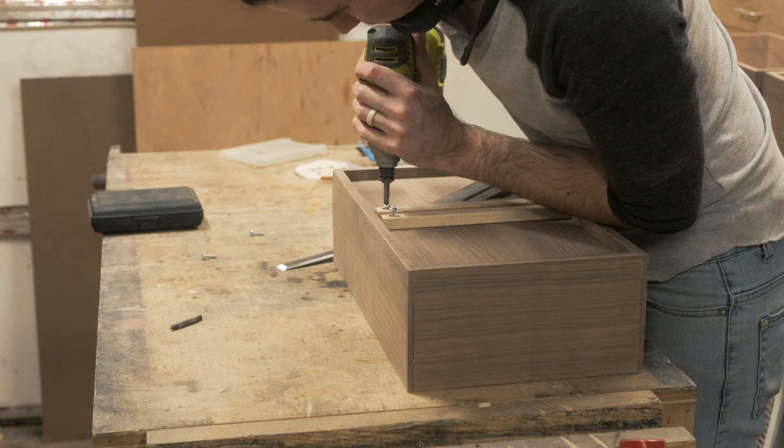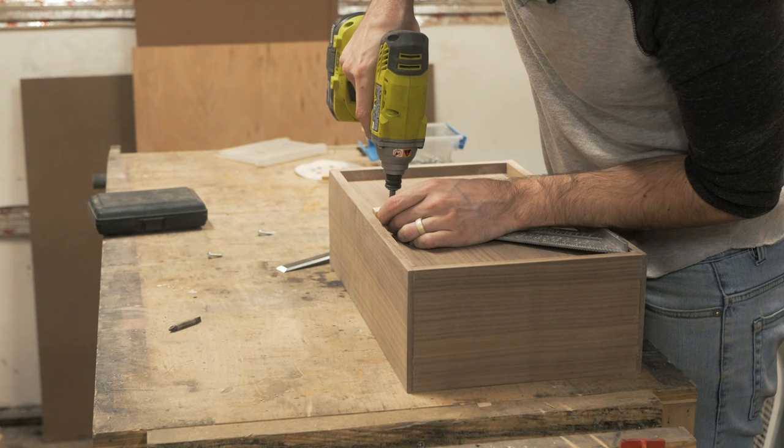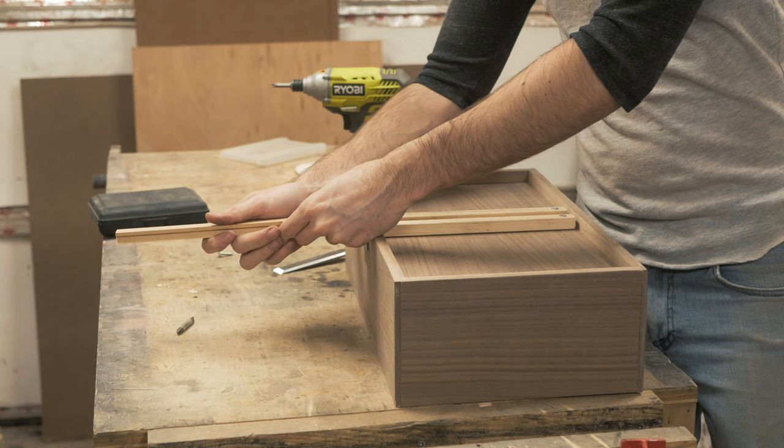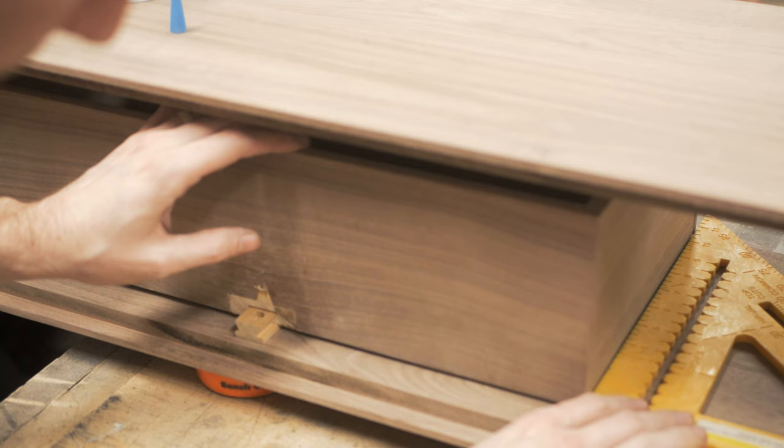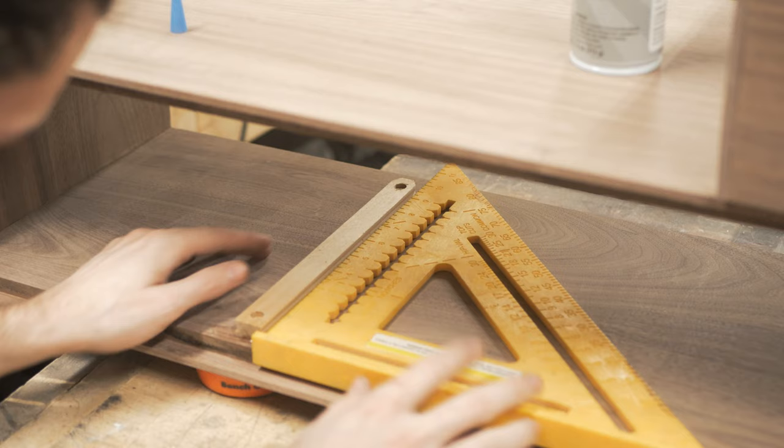After that, I could attach the slides to the underside of the drawer. I also got these clips to attach to the back of the drawer to avoid having to use glue, but I forgot to account for the added depth and ended up removing them. To line up the other part of the slide, I just used a bit of CA glue and activator, then came back later with screws to help hold it better. These drawers won't be open and shut very often, so I'm not too worried about the life of these slides.